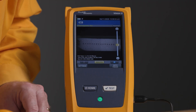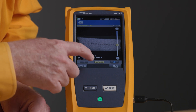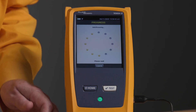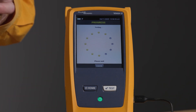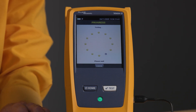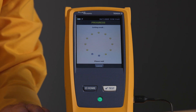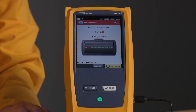The image is live. I'll straighten that out a little bit — there are all 16 of our fibers. We'll tap Analyze and zoom in. Give it a few seconds — it has to look at 16 fibers. It needs to look at the two zones, the core and the cladding, to make sure there are not too many contaminants as required by the standard. And we'll get our test result.